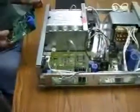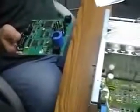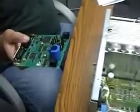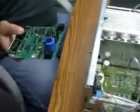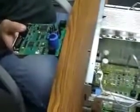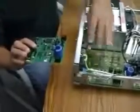A GPIB board is required to do this test, and there's two things as shown here. This board has a part number associated with it, and that part number is Agilent number 5063-4851, and that's a tested assembly that you can get through Agilent support organization. Any other models of the 65 5X series, 65 4X series, and 65 7X series who are working and have a GPIB board, if you'd like, you can take that board out and use it for this testing. So the next step would be to connect the interface board to the instrument, and I'll do that next.